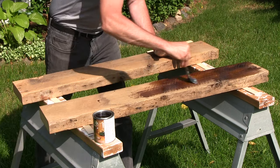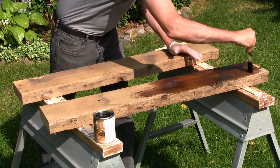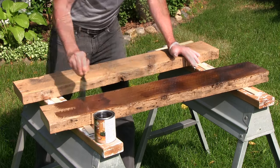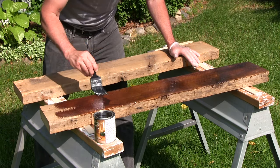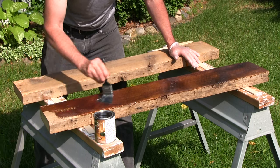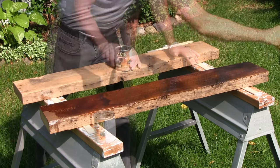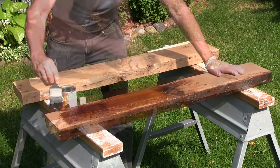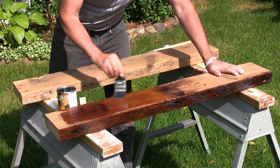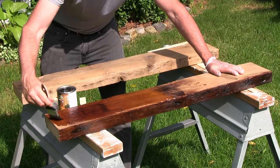I think I'm going to have to start to feather this in — it's drying. It probably should be in a shaded area, but I don't want to overthink this. It says when you apply this you should go in the direction of the grain and not over-brush it, because you can trap air bubbles which can give streaks. It's supposed to be fast drying and dries in two hours. Again I'm probably applying way more than it suggests, but it's just sucking it in like crazy into this dry old wood.